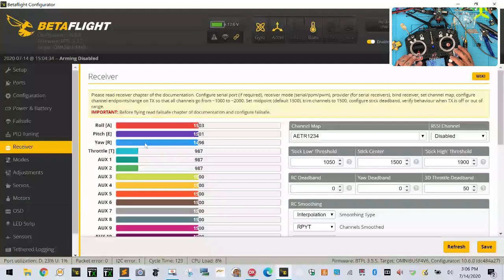And now we're just going to go ahead and fine tune this by going to here. All right, so let's go to our edit, and we're going to go to our sub trim. We're going to turn this down. There it is, 1500. Then we're going to go down. We're going to take this all the way. We're going to click that. We're going to turn it up until it gets to 1000. We're going to go to the max and click this. We're going to turn it all the way down until it gets to 2000. Okay, perfect. Then we're going to go back to our sub trim, and we are going to bring that down.